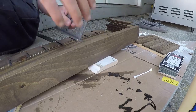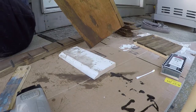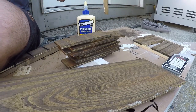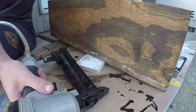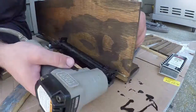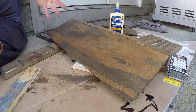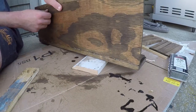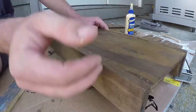After giving the stain ample time to cure so the glue wouldn't be affected, I started assembling. I applied all the glue, spread it with a Q-tip, then figured out the best way to hold things while nailing. The easiest method: put the side rail on a flat surface, hold a square on the backside, clamp the back board against the square and side rail, then tack the nail in at the end. Once you get the first nail or two in position, the rest is easy. After the board is secure, use a clean Q-tip to wipe up all excess glue — even after 24 hours, wood glue can still discolor your stain.